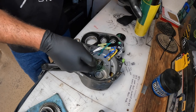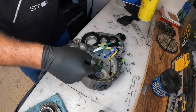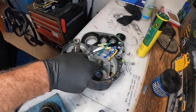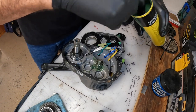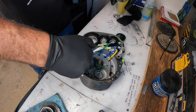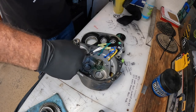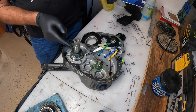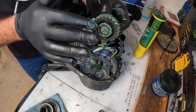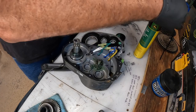Just a little bit at a time. That looks pretty good — now putting a little bit on this pawl, not too much because pawls can stick. Just a tiny bit on there. A little bit on this shaft. Next I'm dropping in this gear, getting it all nice and coated, getting those teeth full. The stuff is pretty runny.